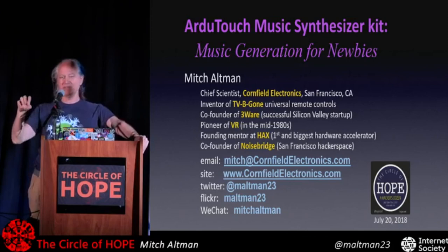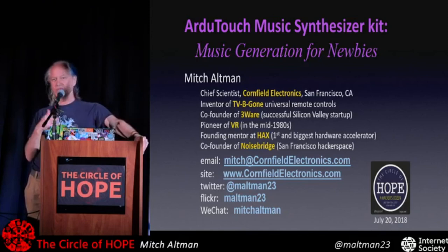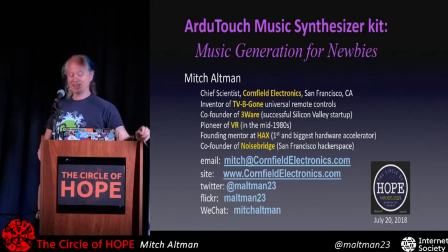And a couple of knobs and a couple of buttons. You can easily add those if you're into solderless breadboards or soldering, and create that on your own with any Arduino. If you use an Arduino Uno, it'll be exactly like the ArduTouch. If you use an Arduino Mega, it can be exactly like the ArduTouch, but you have all these extra input-output pins that you could do whatever you want with. So yeah, you can definitely do that. You don't have to do anything except change the setting in your Arduino software to say I'm using an Arduino Mega instead of an Arduino Uno.